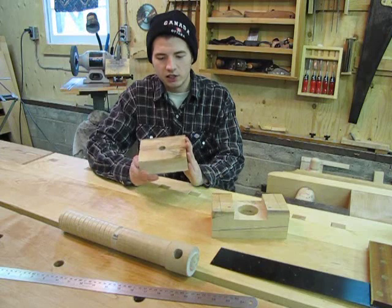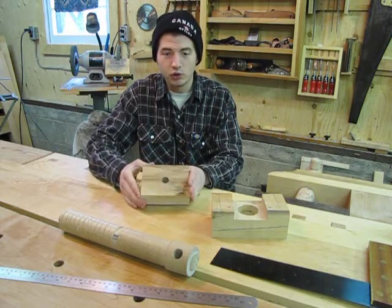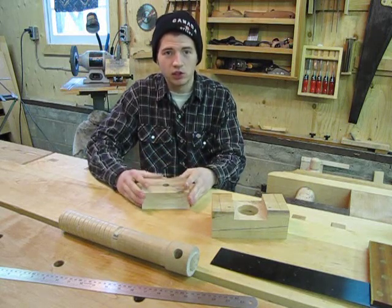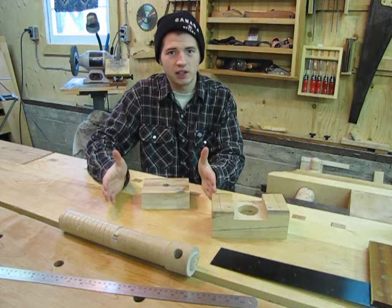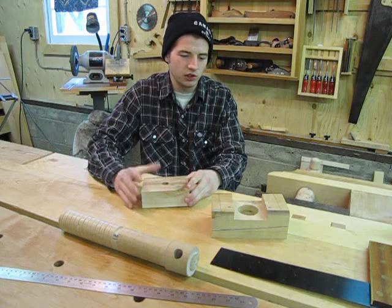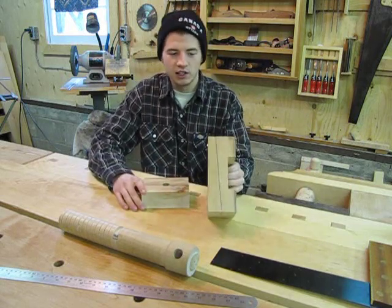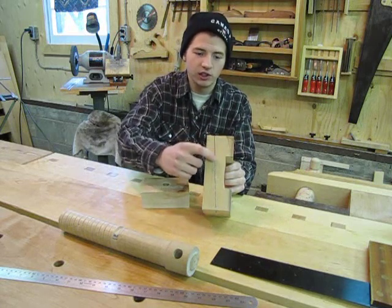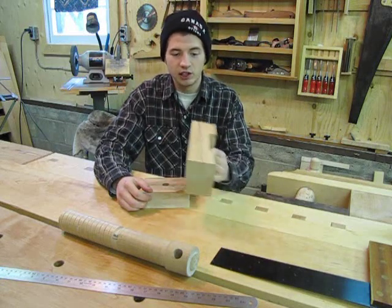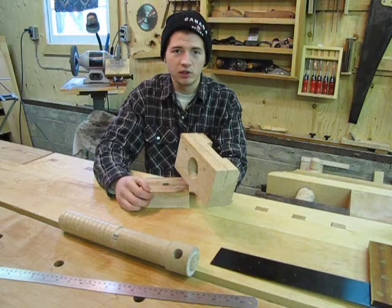You want to make sure that your guide block is no shorter than five inches long, but you wouldn't really want to go too much longer — maybe eight inches at the max. Even that would be kind of pushing it if you're using a hardwood, because you'll need to use a handsaw to cut the kerf in the guide for the steel plate to go in. If you've got to cut that with a handsaw, especially in hardwood, it's fairly difficult.